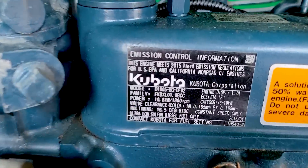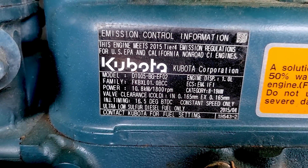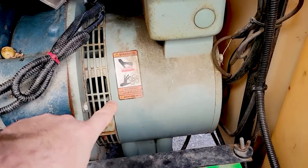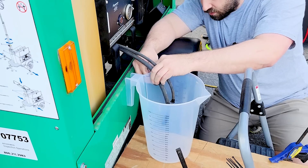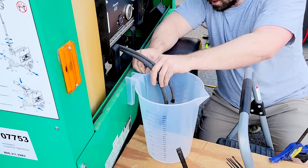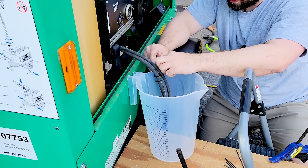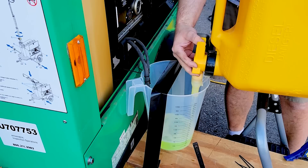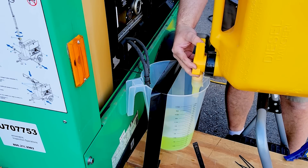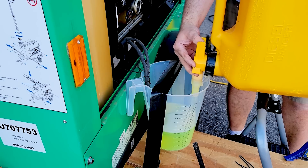Inside we can see the Kubota — it's a one-liter three-cylinder engine connected to a 6 kilowatt generator head and a 30-gallon fuel tank. Up top we have the fuel lines going to these fittings. We cut the crimp fittings off and brought those fuel hoses out of the light tower, drilling holes in the side of the container to zip-tie them in place. There are two fuel lines because diesels have a supply and a return — the diesel fuel is used as part of the lubrication and cooling of the injectors. This is regular diesel from the pump, not off-road diesel.